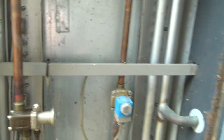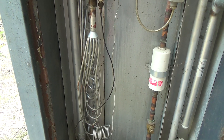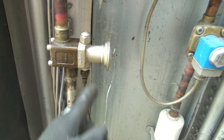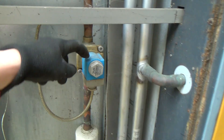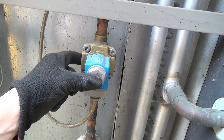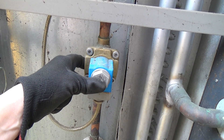Screen went black then. That's the other section — condenser, evaporator. This is a newer one compared to most of the ones we work on. I've had them leak on that joint there. I did hear the guy who used to look after these said they used to take the guts out of these because they used to have trouble with them starting — I think the thing would go off on LP before it got going.